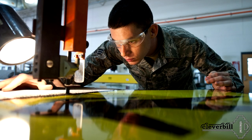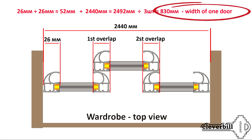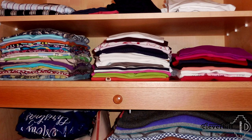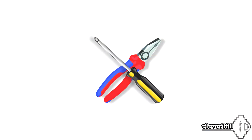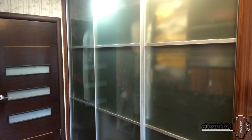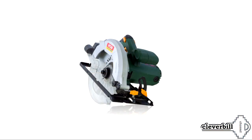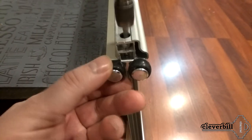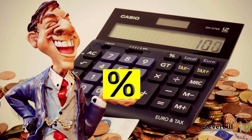It is also possible to make doors from an aluminum profile for a cabinet at home. The main thing is to calculate them correctly, take into account the internal filling of the cabinet, pantographs, drawers and compartments. To make doors, you need to have the necessary set of tools and also have the skills to work with them. Filling doors, or as they are also called, inserts, can be ordered in size in a glass workshop if it is glass or mirror, and if it is MDF or other material, you can safely cut it yourself. Making doors with your own hands allows you to significantly save money, since manufacturers lay a decent percentage of the price of the material precisely for the work done.